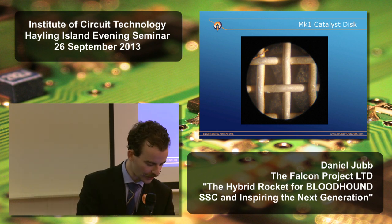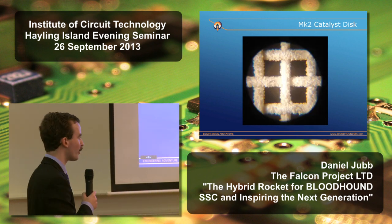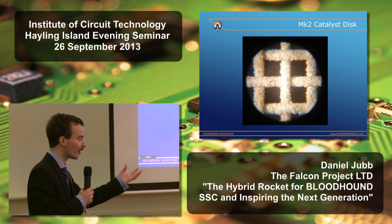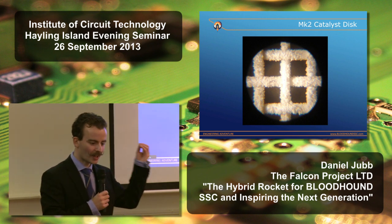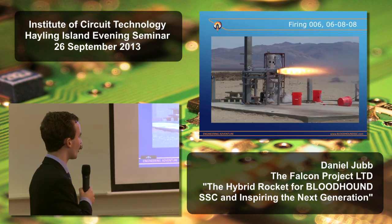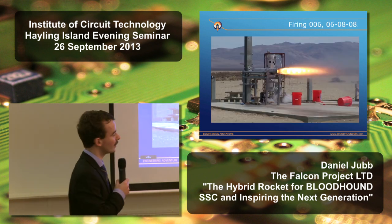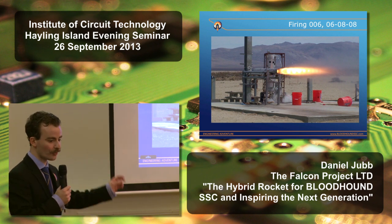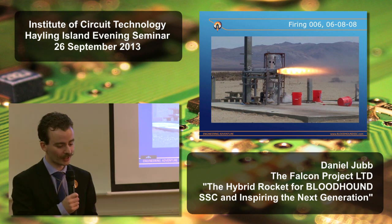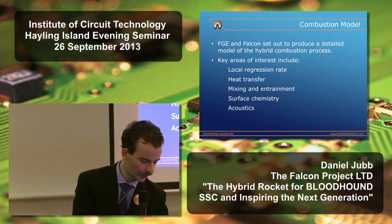So we sought help from the electrochemist who worked on those catalyst packs in Black Knight and Black Arrow, and he showed us how to increase the surface area of the silver, harden it, and that was the Mark II disc that we produced. As soon as we put that into a rocket engine, the test program was well and truly underway. So that's the sixth firing of the 6-inch chamber. You can see now that the shock diamonds are starting to form in the exhaust, clearly visible, usually a good indication that the thing's working well.